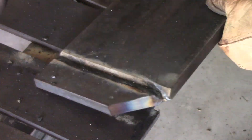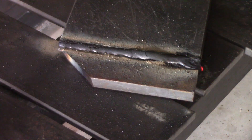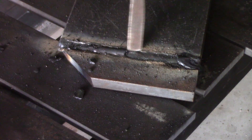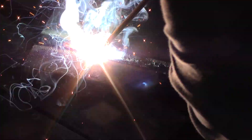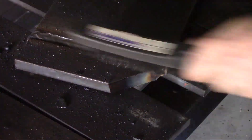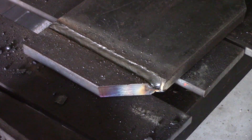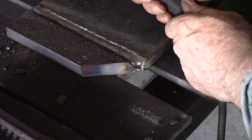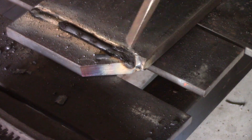I was actually just a little bit proud of the surface so that I could give it a light grind and get it down level. I'll just mention that I welded this onto the bottom of the horn because that's where the stresses are going to be the lowest. I used a wire wheel brush to clean off the flux between passes to make sure I had no contamination in the join, and I was careful not to let too much heat get into the job. I didn't kill it with water or anything like that, but I did leave it a little bit between passes so that it could cool down a bit.